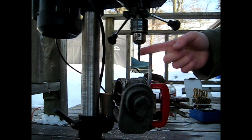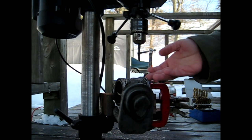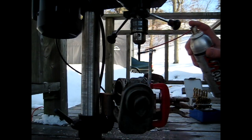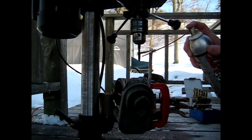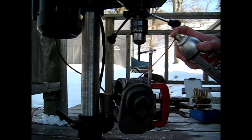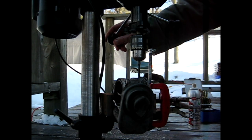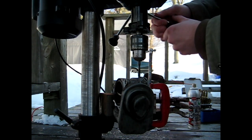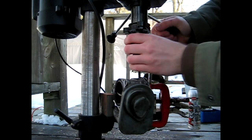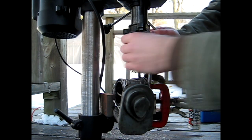I've already added the tap into the drill press, but I'll leave the drill press off because when tapping it's pretty hard to get accurate. First I'll apply some oil to the threads of the tap — it helps it cut a little better and does a nicer job, providing lubrication — and apply a little bit to the hole as well. Then I'll feed the tap down, making sure there's enough travel on the drill press, and simply apply enough pressure and thread it in by hand.